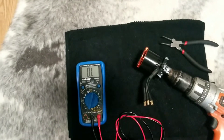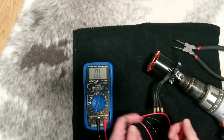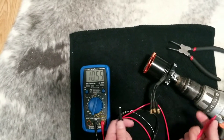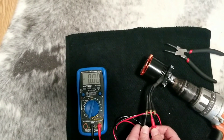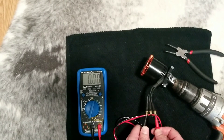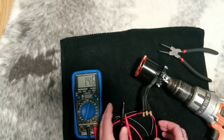So the multimeter — cheap, I suggest everyone has one. You get them from 20 to 50 bucks. Got the ohms setting, so I'm just going to check the resistance. This will tell you if you've got a short in there or not. You're good on that winding, good on that one. I'll switch over to this side — so that shows good.